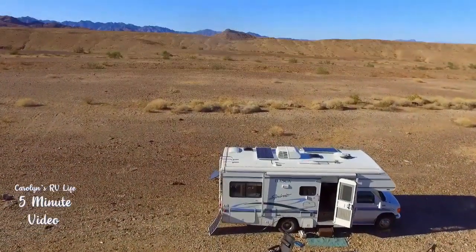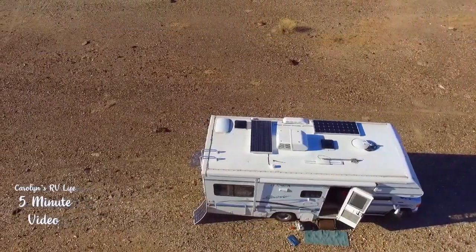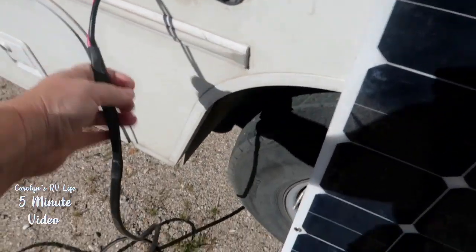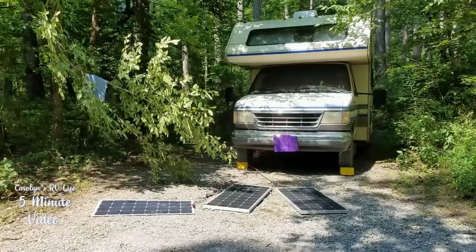First of all, let's talk about what I use to power my RV. I have 360 watts of solar — 260 on the roof and a 100-watt flexible solar panel that I have plug-and-play on the outside of my RV so I can totally maximize all of the sun. I love the flexible solar panel because when the sun is setting I can put it up and get extra power that isn't hitting the panels on my roof. Sure, I could tilt the panels on my roof and I have the hardware to do that, but who wants to climb up and down off their roof all the time if you're moving a lot like I do?